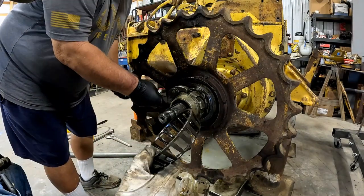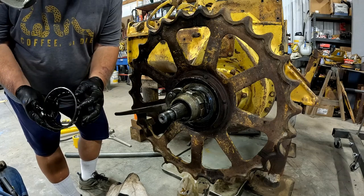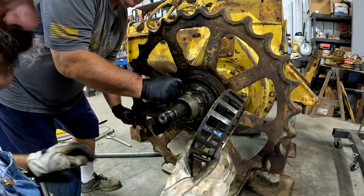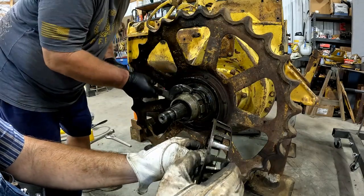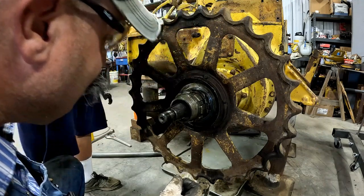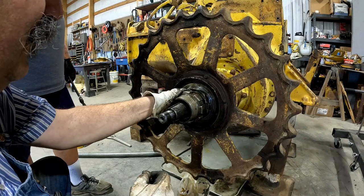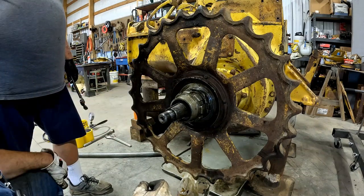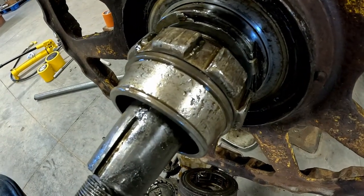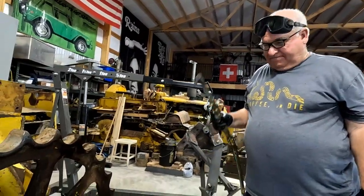See how the back of this has been battered up? There are nicks and marks — look at the pits in there. We're done playing nice with this inner race because that nut has run out of threads and it's not pushing anymore. Do your torch thing, cleaner. That bearing is shot, shot, shot.